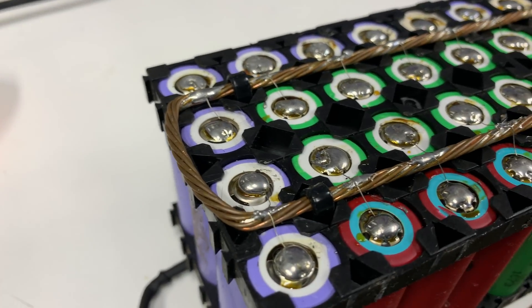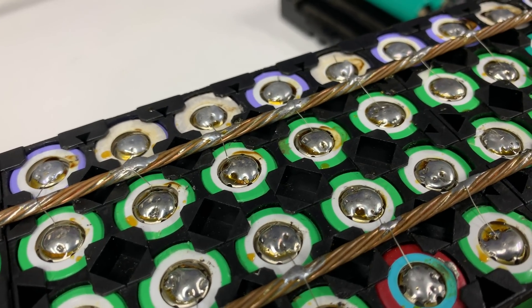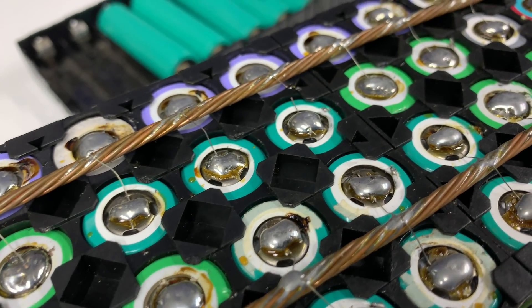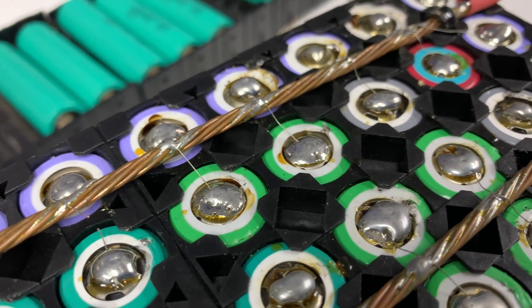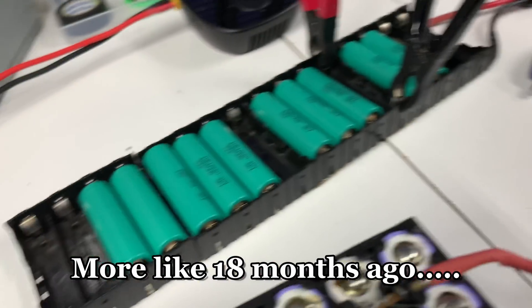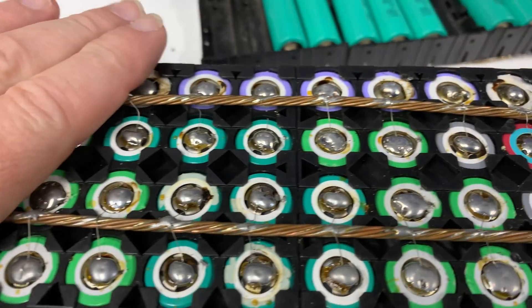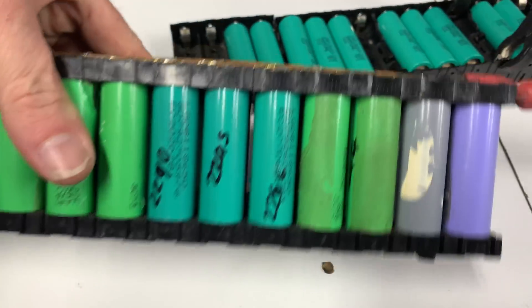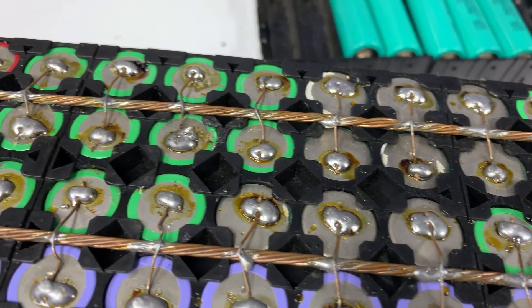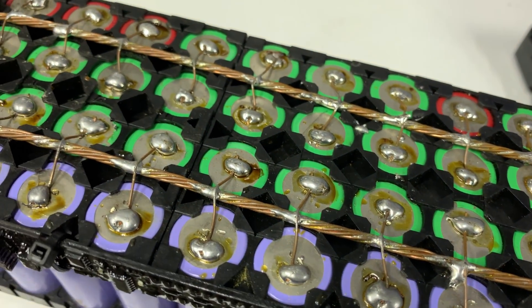That's probably the world's shortest time lapse. A bit of a visual inspection, nice and slow. Having a quick look at that, I can't see any fuses that are broken, and I'm just visualizing that through the camera screen. Plenty of old flux there. This pack was made about two and a half years ago. That is the positive side - it looks like there's plenty of 2200s in there, 2300 cells, couple of Sanyos, no heaters thank God. There's no heat coming from it at all.